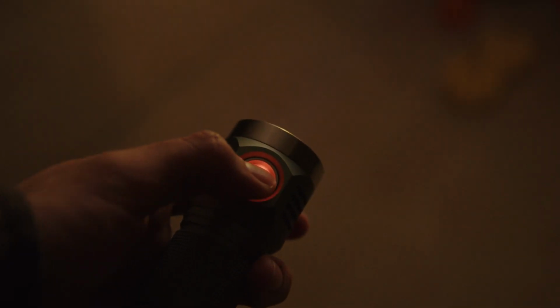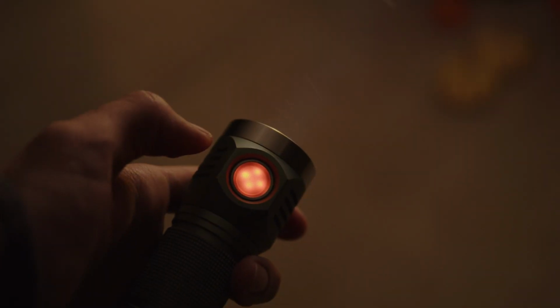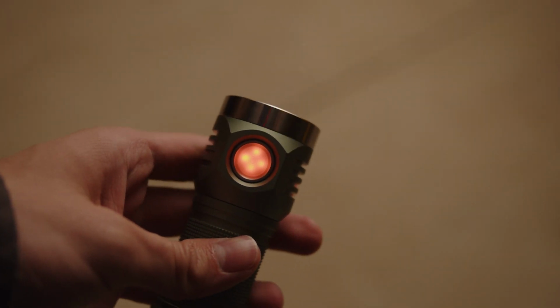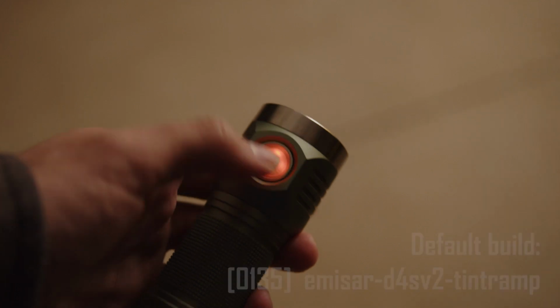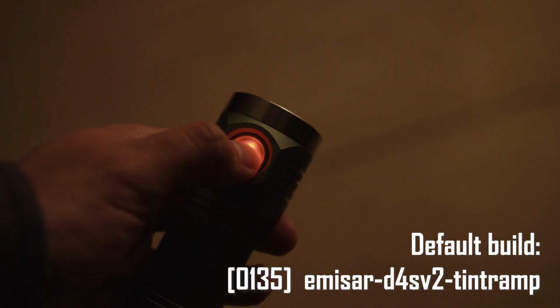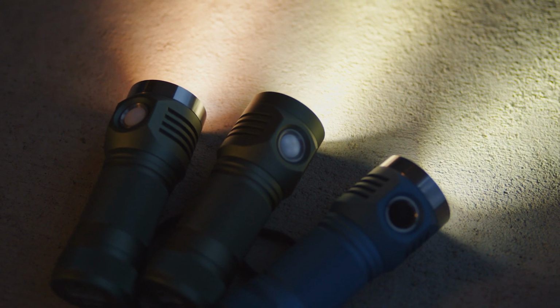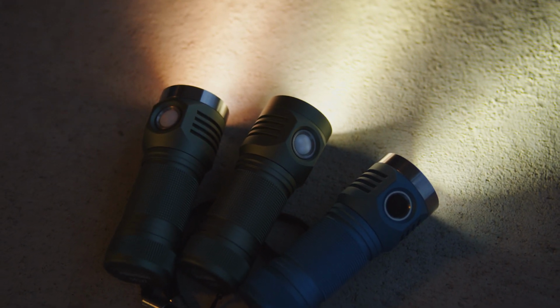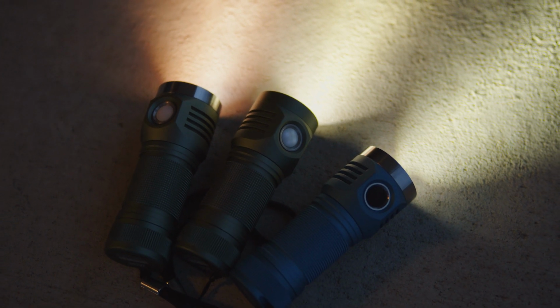There's actually a FET physically present on channel 1 of this driver, but I do not recommend activating it, as only 2 LEDs are wired to use it and would almost certainly be burned out upon its activation. So just be mindful of what you're doing should you reflash one of these lights with different firmware. When ordering these lights, they will be configured with the appropriate maximum current level for the selected LEDs, so you won't have to worry about LED compatibility when purchasing.